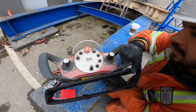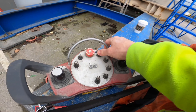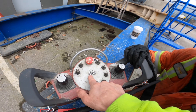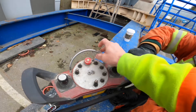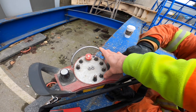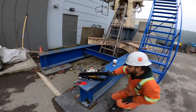While holding those buttons, we release the e-stop, hit the power button, and what you'll see is it's rapidly flashing — that means it's in teach mode. Just for illustrative purposes, if we were to power this up without holding the two buttons down on the remote, it flashes much slower — that's not in teach mode. The rapid flash signifies it is in fact in teach mode. Connect, power up the electrical, and there we go — now we are in teach mode.